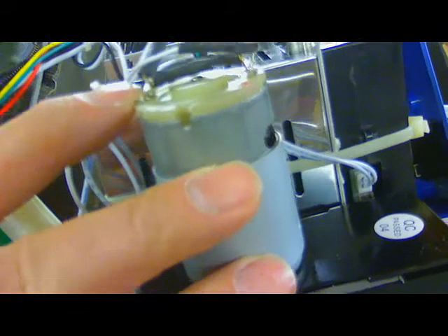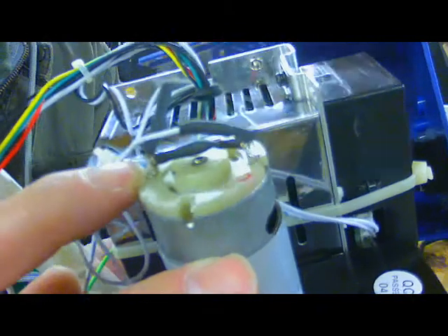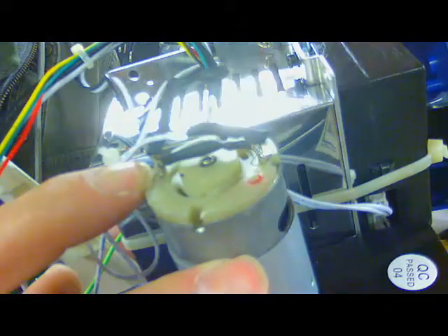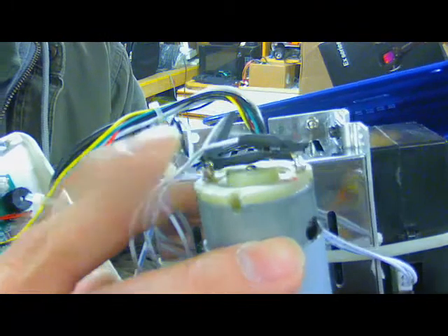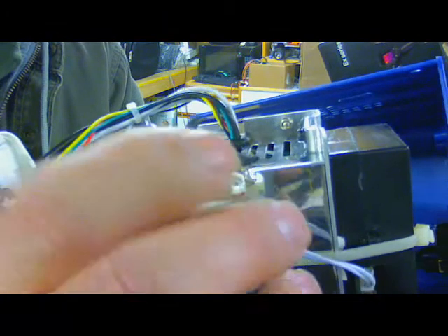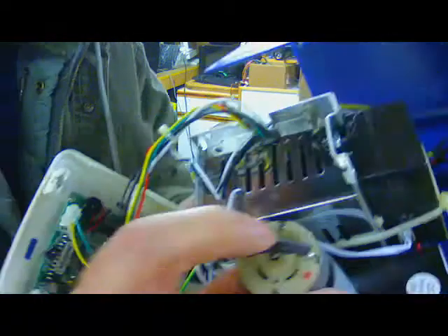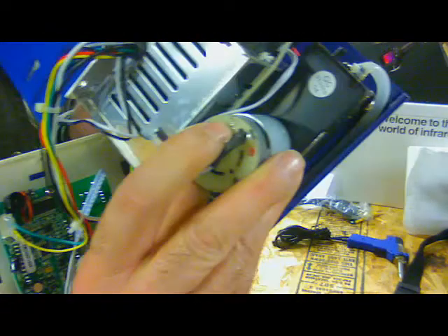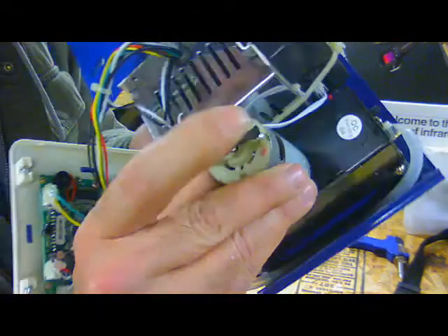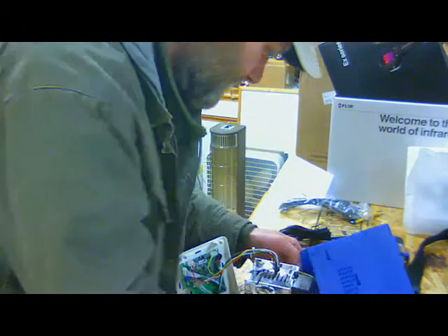See right there — I can't hold this still, I don't have a tripod to get this thing in there that close. At any rate, the wires hooking up to the motor terminals here are just barely hanging on. There's a big old solder splash right there, right above my fingertip — what kind of a crock is that? I'm going to go through this whole thing and see if I can find anything else that's going to come out and explode at me.